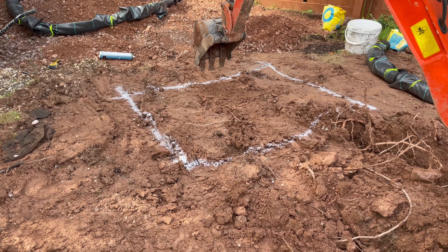This is what the crate looks like — four of them together. Now we've got the weed membrane to wrap around it, pick it up, and put it in the hole. The soak away's in the ground at the required height. I've cut a hole in it there, and there are another three holes cut out to connect up to the pipes, including the one along the sleeper wall. We'll put a load of chippings in around the side of it now, then re-dig the trenches so it all connects up nicely.